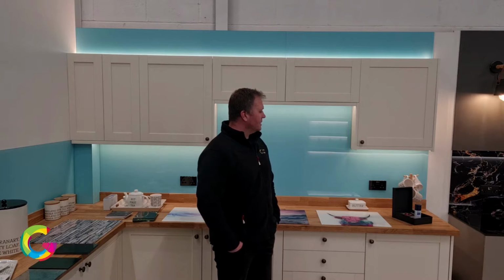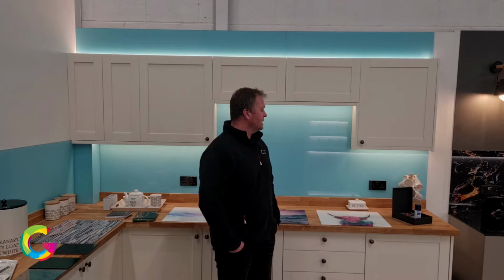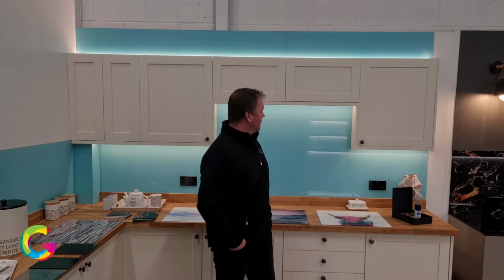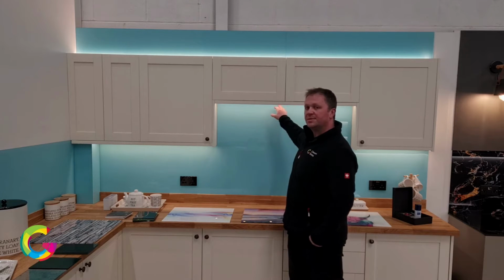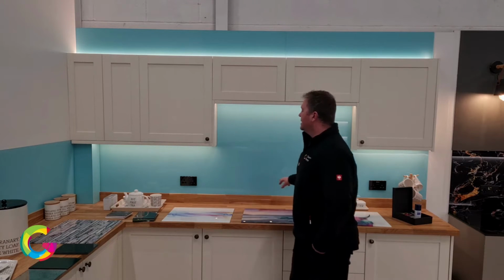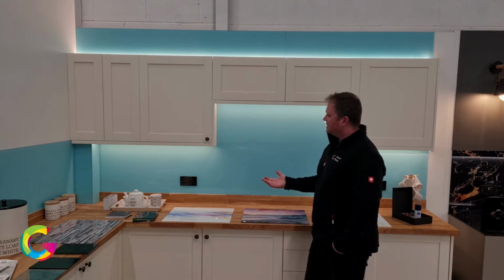The way that the pricing works is per metre squared. So you pay for the amount of area of glass that you need. And there's also a couple of other factors that affect the price. The first is the edges of the glass. The glass needs to be cut, and then the edges need to be ground and polished. Now this is charged per linear metre, so that's charged for the length of the edges, and that can be different depending on the shape of the glass. So if there's a lot of cutouts, there's actually more polishing. So that's an extra cost.